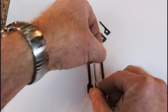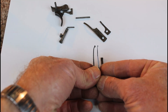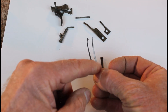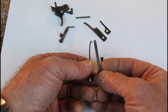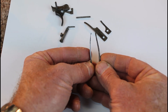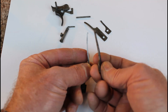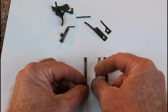Turning these up on edge, the kick off to one side or the other is one problem, but you can see this one on the left — right out toward the end where the round spot is — kicks up really hard right there, and that makes this spring too strong; you can't hardly get it all together. You can see how difficult these springs would be to make: they start out thick down at the base, get thinner, then curve up, with a rounded spot on the end. The gunsmith that made this one got the dimensions really good but didn't quite get the contour right. The one on the right has the contour completely opposite of what it should be — I think it was probably in a house fire and got so red hot that it lost its heat treat and temper and just bowed the wrong way. We're going to give it a shot anyway, so we'll get over to the torch and get these things heated up.